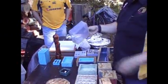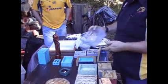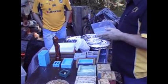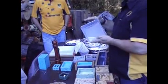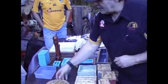Again, these are just plastic. Cast it how you like, give it a tap. The biggest problem with most of these containers is they have a round bottom, and getting them to square is a real problem. And so this one is pretty good, it's pretty square, but you'll find most of them have a real big radius and you waste a lot of resin. I then started making my own.